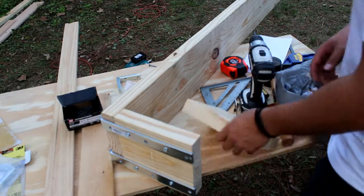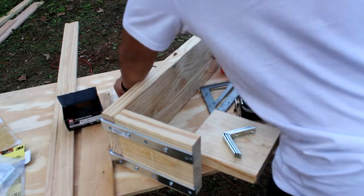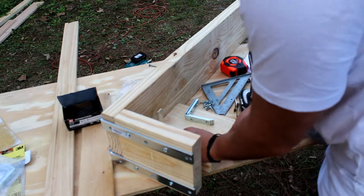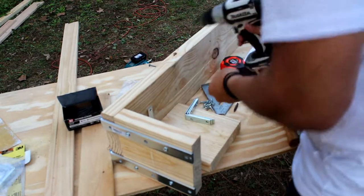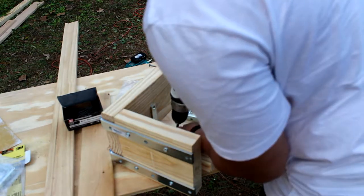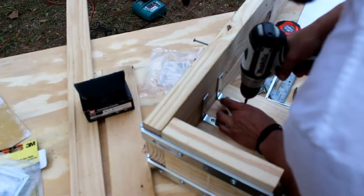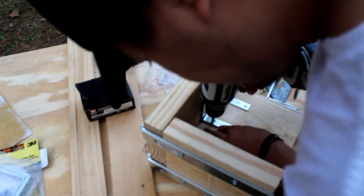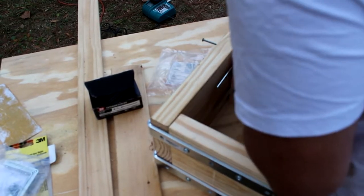At this point, we can begin assembling the rest of the shelf. I have smaller L brackets for these. Since all the wood should be straight, just lean the shelf segments up against the 2x8 to mimic the position it will be installed. This way, I don't install the brackets incorrectly, just to be safe. Then I install the segment at the next marked location up the shelf.